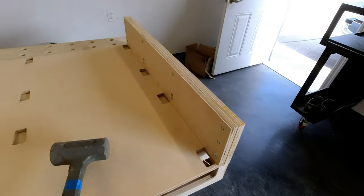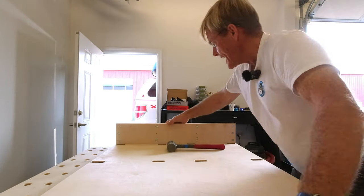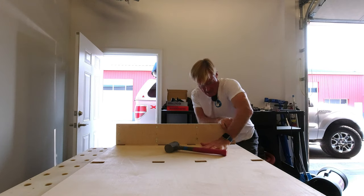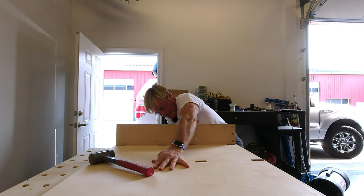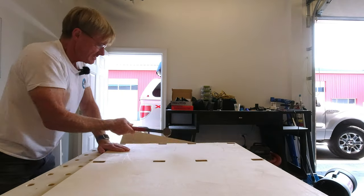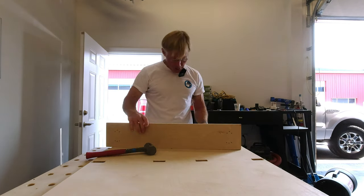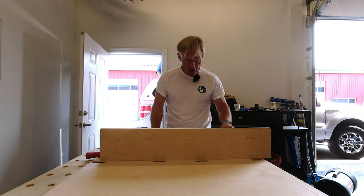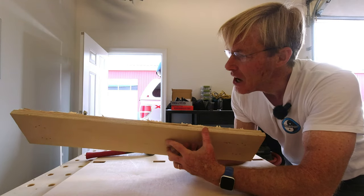Let's look at the other side. I've already knocked on this one a few times as well — you can see how strong that is. I'm not going to break that off. Again, another three strikes, and I had at least five or six in before, knocking it along that edge. Again, it's all wood that broke — the glue line did not give up.